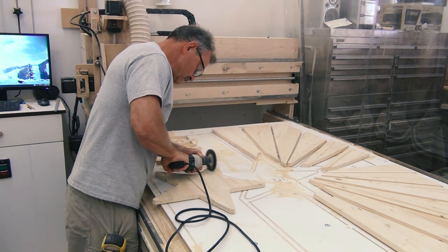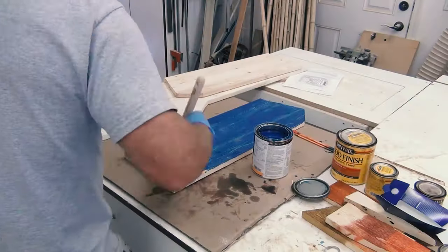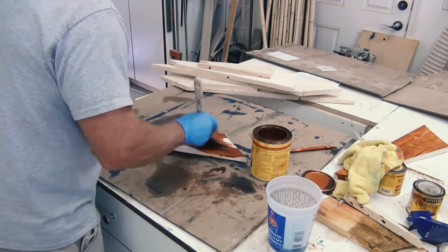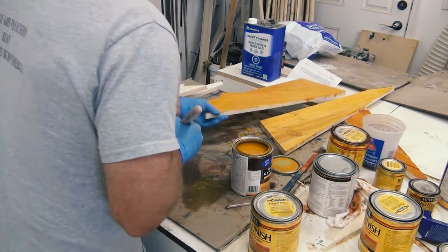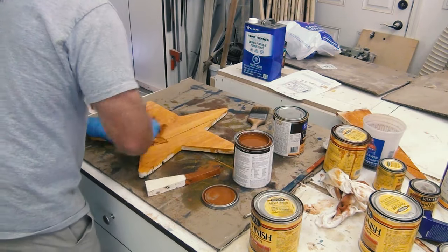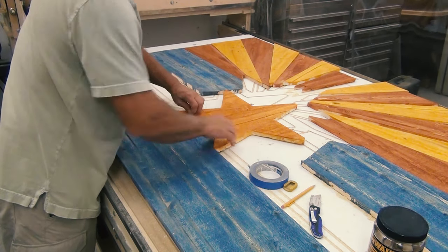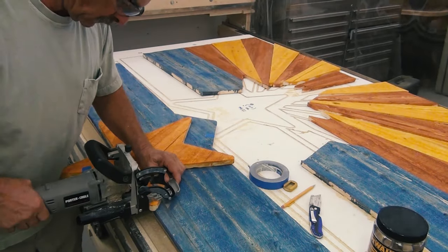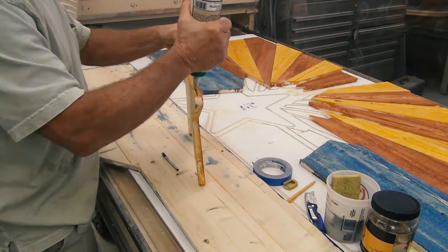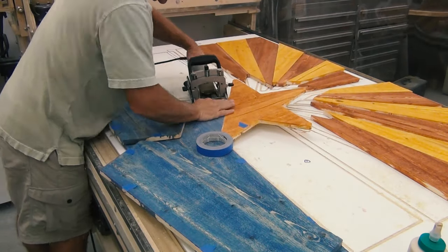After all the parts were cut out, I cleaned up all the glue joints with a little wire wheel and maintained that rustic look. Then did a dry fit and, believe it or not, it fit. So while it was in pieces, I painted the blue parts blue, red parts red, and yellow parts yellow. The star is going to be a slightly different color so it got two coats of two different kinds of stain. The hardest part of this build was figuring out how to put it together. I laid out marks with tape, used biscuits, and clamps — it was tedious. I finally settled on using pocket screws because some of the angles were tough to clamp. It was a long exhaustive process, but we finally got it together.